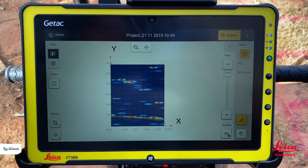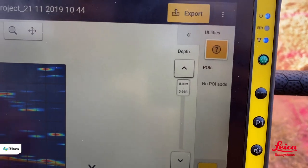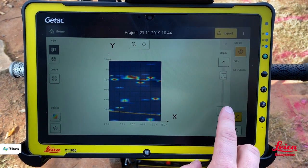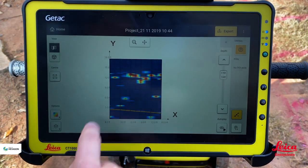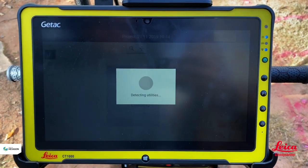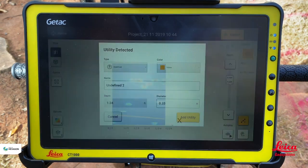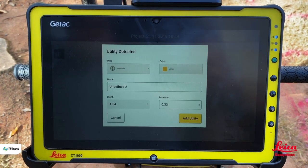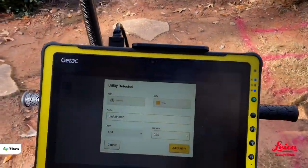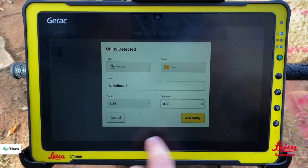The slider bar on the side tells us we're analysing at 0 to 0.6 feet depth. I can carry on going through the data to see if anything else is down there. All of a sudden there's another cluster that's appeared. I hit 'Add Utility' again and draw the line in to check if the software confirms a utility. This one is likely a gas line since we can see a gas meter on the side of the property. It's approximately 1.3 feet down, but since we're not certain we'll leave it as undefined and just add the utility.